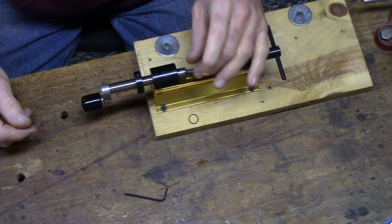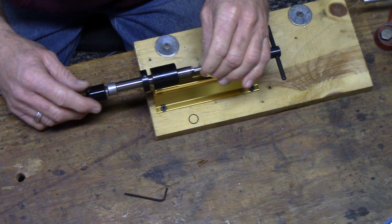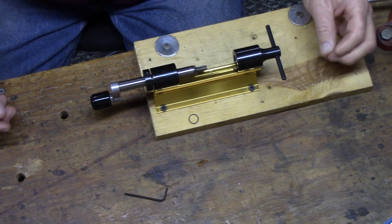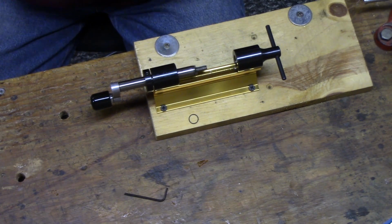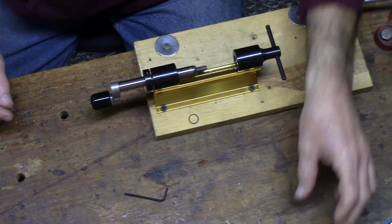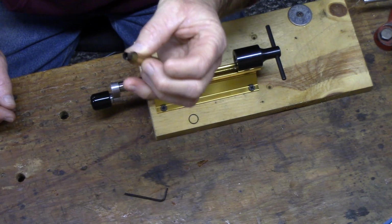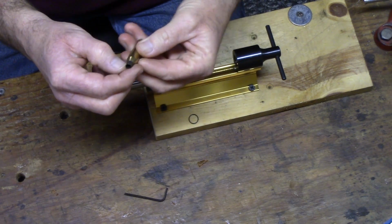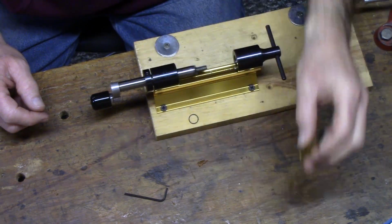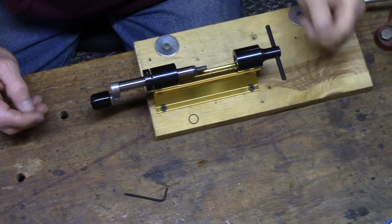Very simple. If you got lots and lots and lots to do, high volume, trimming the inside is obviously quicker, faster, easier. Myself, I prefer doing the outside. I'd like to have the neck the same diameter regardless. This stuff here, modern manufacturing, that's what we can thank for brass that's like that. I mic'd a few of these, probably a dozen of them. They run about 14 thousandths, 15 thousandths consistently. I had one that was 17 thousandths.